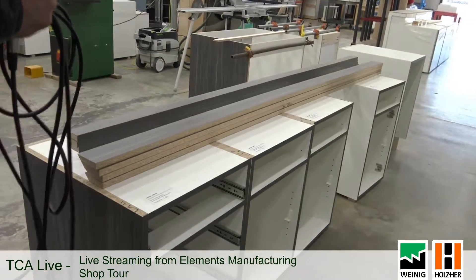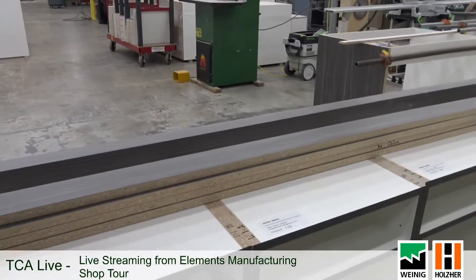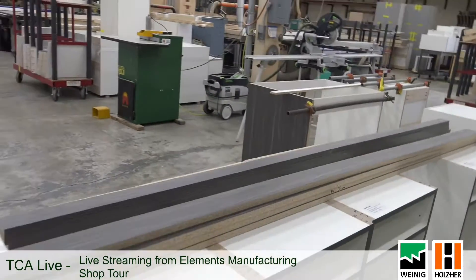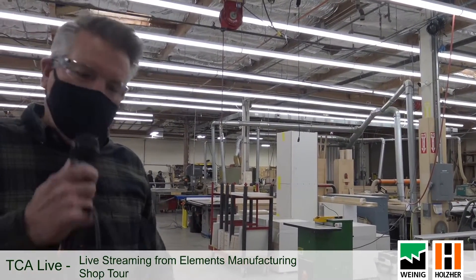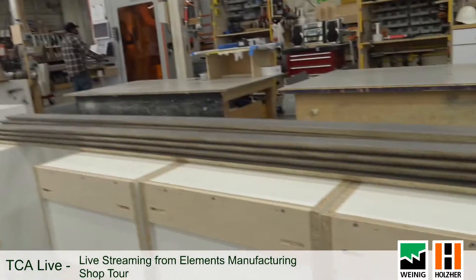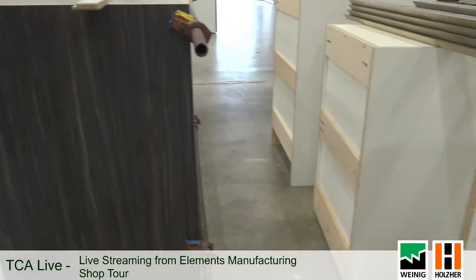This particular job is a break room for Sobrado El Camino. These look like fills to me. One thing I'll point out is that these are mitered — the reason we do miter fills is it allows you to do one less visible seam at the top of the cabinet. If you've got a cabinet top and then a fill on top of it, you could miter that and eliminate one seam. All our commercial cabinets are industrial-grade particle board with half-inch nailers along the back, typically white melamine interiors, and a lot of laminate and TFL — thermal fused laminate — exteriors.